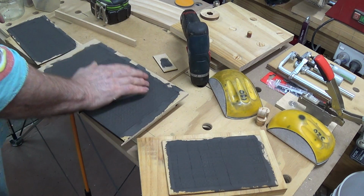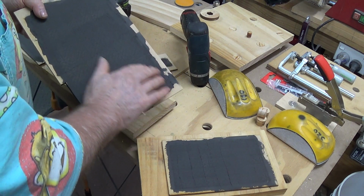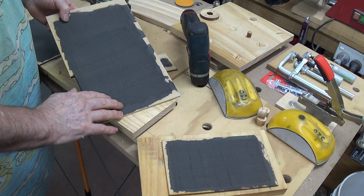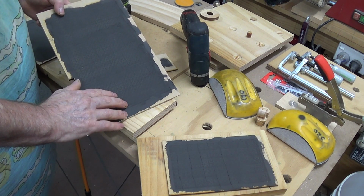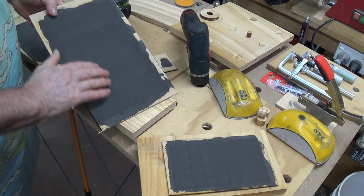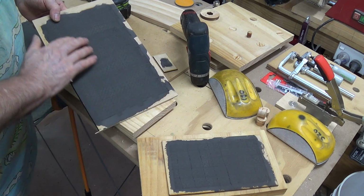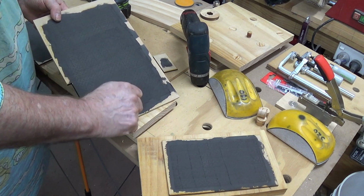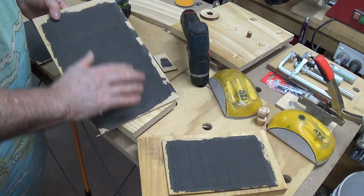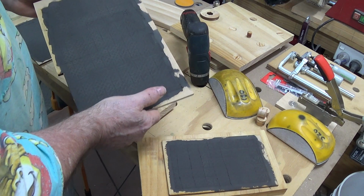is naturally sand to get rid of the first layer, because it's only a rough layer of Timbermate wood filler. I use the ebony, of course, and there's still a lot of parts I might have missed. Rather than go absolutely stupid and give it a really thick layer, I've given it a relatively thin layer, so it will require another layer, but the next layer will be just a skim coat.